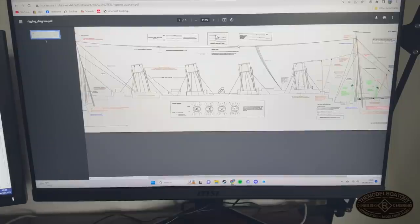And this is a fairly common thing. You see it, you know, in ships rigging. Things like telegraph poles always have this catenary effect. Overhead lines for railways, same thing again. And it is inevitable that you will get a sag, because the maths for catenary tells us that you would need infinite tension to pull that cable entirely straight. So of course you can't have infinite tension for a number of reasons. Firstly, because you can't create infinite tension, but also your anchor points would fail, or your cable would fail.